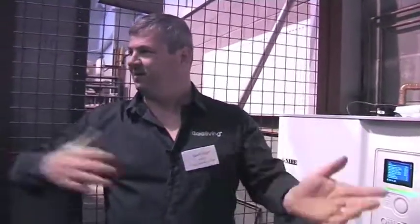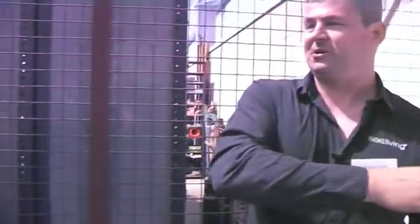In an open plan area there's no point having a thermostat at one side and another at the other expecting reasonable control. In the UK we tend to have the dining room closed, lounge closed, and with that layout the need for zone controls is more relevant. But it brings us back to where we'd love to have no controls and let this sophisticated control system do its job. Yet we constantly come up against systems with 10 or 15 different zones controlled by thermostats, and people will turn down all the stats but not touch this unit because they're frightened of it. That creates an imbalance and it's not an efficient way to run it.